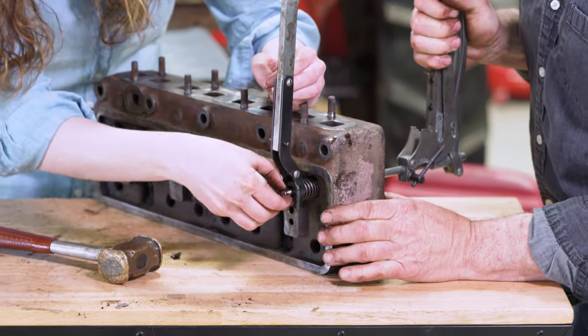We're going to tighten these down — these are our head bolts here. Once you have these started with a regular socket wrench, you can follow with a torque wrench. The spec for this specific engine is 70 to 75 foot pounds of torque, and you can look at your manual if you're working on a different engine because your specification will be different. Whenever you tighten down a head gasket, you should work in an X pattern — start in the center and work as an X all the way to the outside edge. We often like to start at about half torque spec, so we'll tighten them all to 40 and then go back and do the 70 to 75 foot pound spec to tighten it up completely.